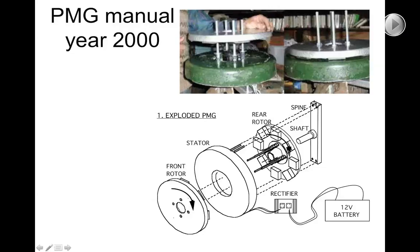The magnets in these machines are fairly widely spaced because even ferrite magnets in those days were quite expensive. Nowadays ferrite magnets are much, much cheaper, so I wouldn't actually build an alternator with the magnets so widely spaced. With ferrite magnets I would tend to cram them together much more closely.